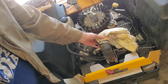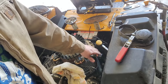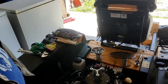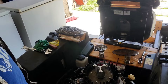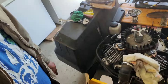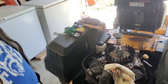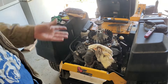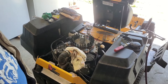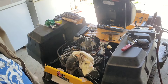I've just taken the air compressor and blown out all the grass from in here. Make sure your air intake is plugged up. We drained the oil and are changing it — I put a new oil filter on and the dipstick lid is on so nothing gets in the oil. You want to make sure you get everything out so you don't have issues the rest of the season. I'd recommend doing this every year, or even twice a year. This applies not just to Cub Cadet but any fan-cooled, air-cooled, or even liquid-cooled lawnmower — make sure you get all the grass out of the radiator too.